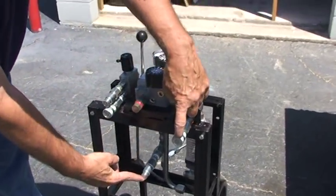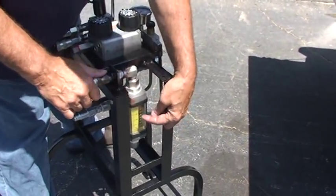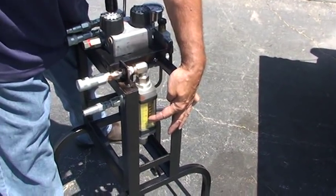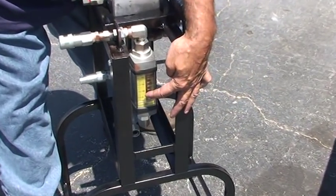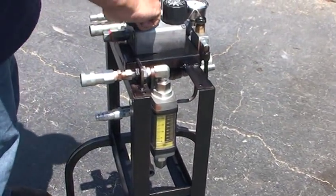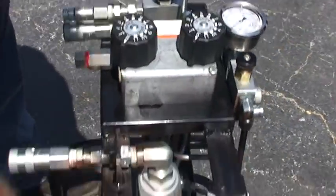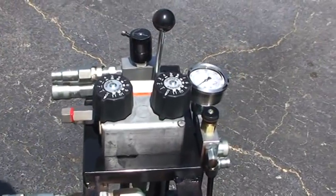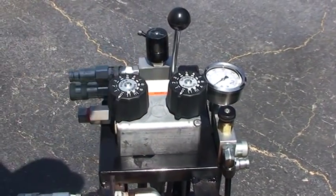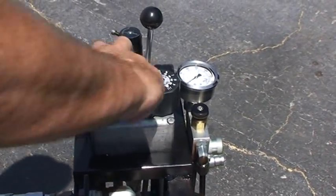From the power pack here, on this flow meter you get to measure the output of the power pack in its entirety — meaning the full potential of the pack, let's say 10 gallons a minute. Then we come up here, we set all these to zero, we read that gauge and it says 10. We have a primary and a secondary circuit, so we want two gallons to go to the tensioner and eight gallons to go to the drive wheel.